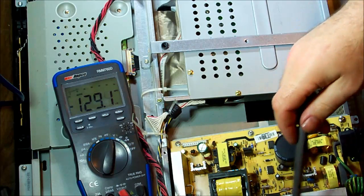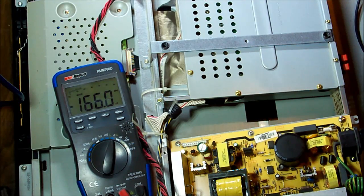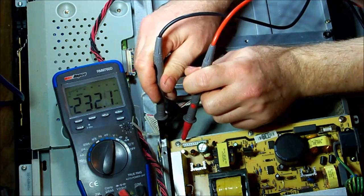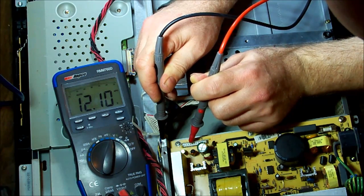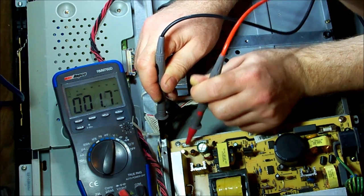Although I can't follow the traces for sure without flipping it over — unless it's got maybe power factor correction, though I think that's usually only seen in plasmas with a big load on the mains. Anyway, next thing I'll check the lines to the motherboard and see if there's any short on them. I can't remember which pin it was — one, two, three — pins three and four, and one looks like ground.